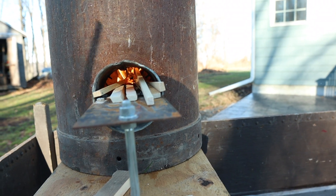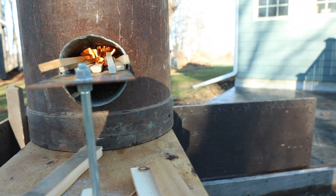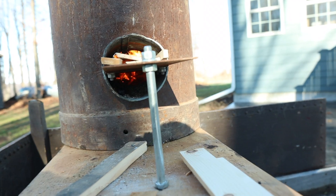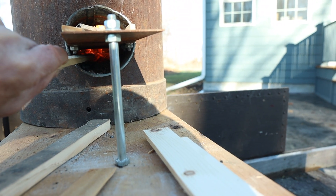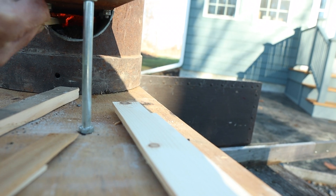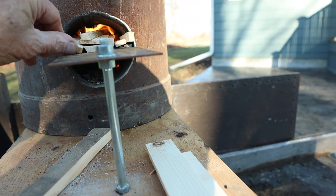It's really going good now. You can see the fire down the top as it really heats up — she's cooking. Underneath the shelf you can see some coals showing. That's what happens: coals burn and come down, keeping the air passage clean. Feed the wood in the top and clean out the ash on the bottom as it comes down.